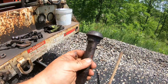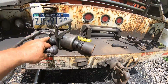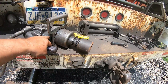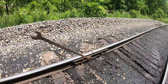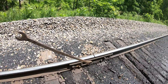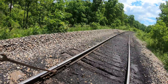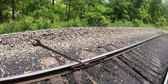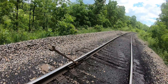These are called button head oval bolts — they're grade five bolts. I don't know the exact torque this unit is set at; this is actually a unit we borrowed off Frontier Railroad because the one I had was broke — it's got gear teeth missing off the gears. Anyway, we like to put these bolts torqued at somewhere around 300 pounds, and that's about what a guy like me can do with a track wrench. The AREMA specs for grade five track bolts are higher than that, but we've got 17 miles of jointed track and we tried way in the past tightening them up to specs and the rail just won't move.